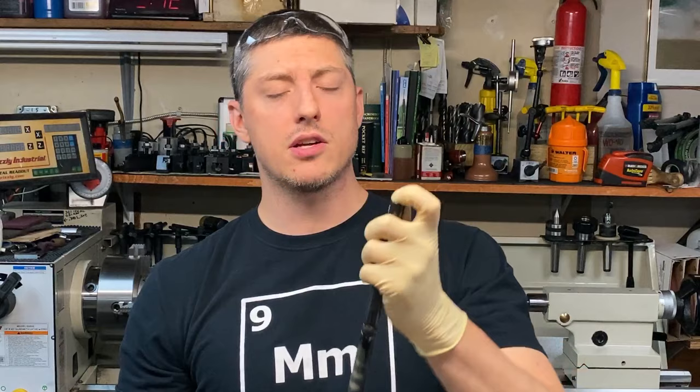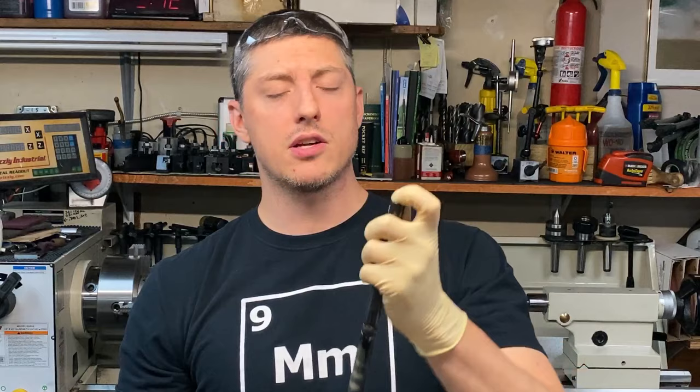The concentric thread concern comes from me seeing Remington barrels as far as five thousandths of an inch from center, to S&W barrels that are out as fourteen thousandths of an inch. And let's say you wanted to use a sound suppressor that costs you $1,500 — the last thing you really want to deal with is having a baffle strike.